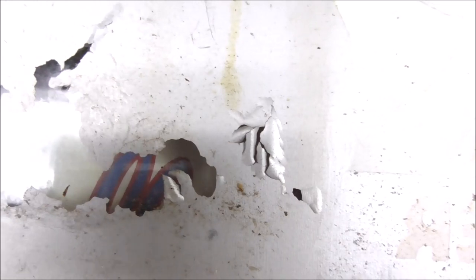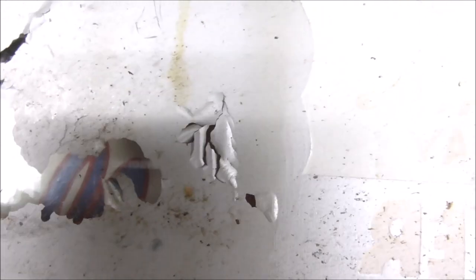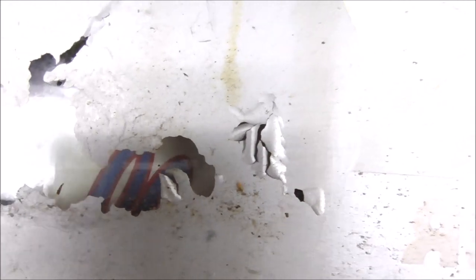This side of the Saran wrap is dry. That side of the Saran wrap is completely covered in paint, and you're pushing the chips back down into the paint. Once you get them where they go, you stack something on top of it that's heavy. It's a piece of glass, folks, so don't go crazy, but just something that'll hold that paint down flat, and then you let the paint dry. And the chip will dry back in place flat. So the best place you'll see it is up here. Whenever we do it up here, that will go right back down flat.